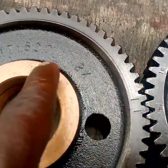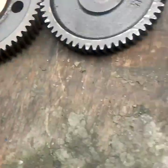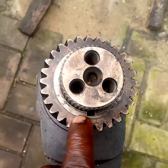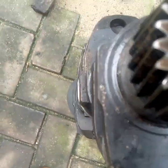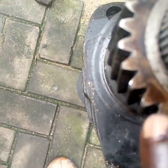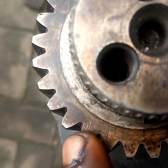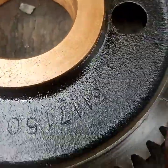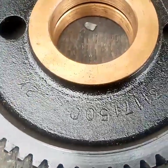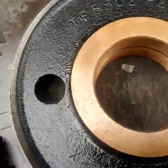The injection pump timing mark has two options: it has four and six. If you come across something like that, I usually like to use the lower number first. If you try the lower number and the engine is not starting, then you can go to the higher one — you can try six. If you notice the engine is knocking, then come down to the lower mark. So when your injector timing mark has two options, use the first one; if it's not working, come down to the second one.